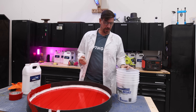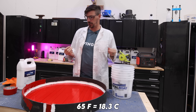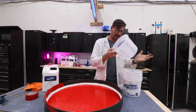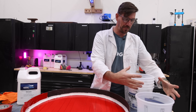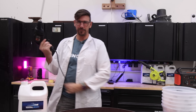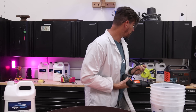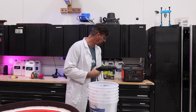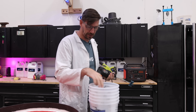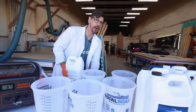One of the things I'm worried about is the fact that it's about 65 degrees here in the shop, and as I mix up the 2-to-1 high performance resin in these gallon buckets, it's too deep of a mix and it's going to kick on me really fast. It's about 35 degrees outside, so I say we take the Jackery outside, plug into that, and mix outside where it's nice and cold. That should prevent this from kicking too fast before we can get it into the mold. We don't want premature kickulation.